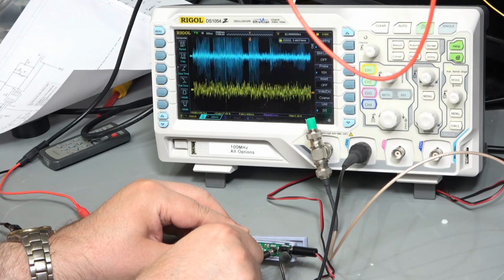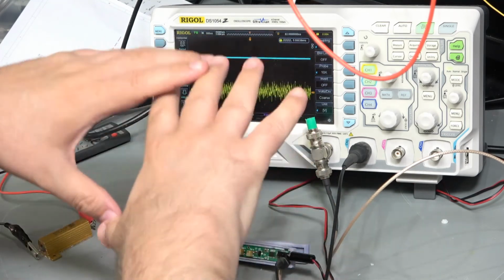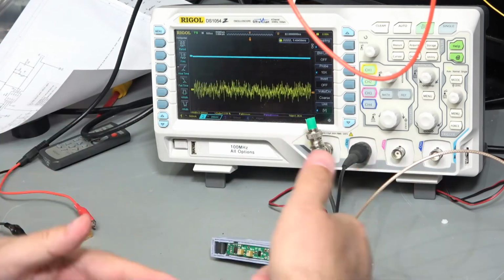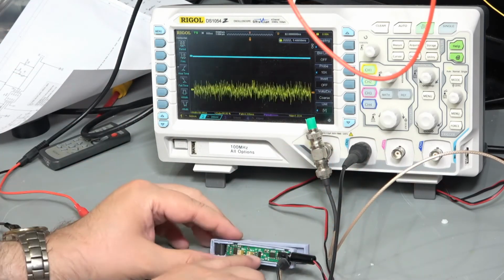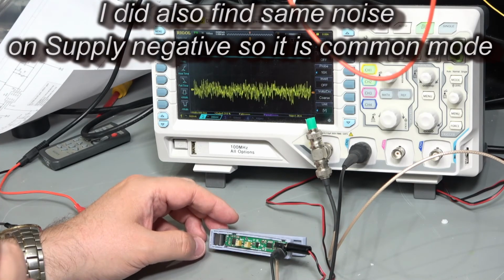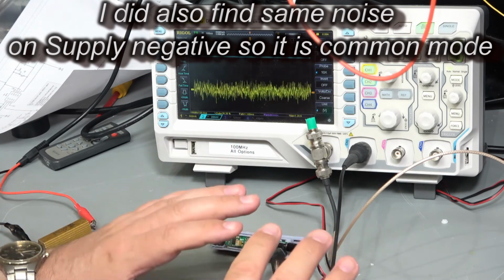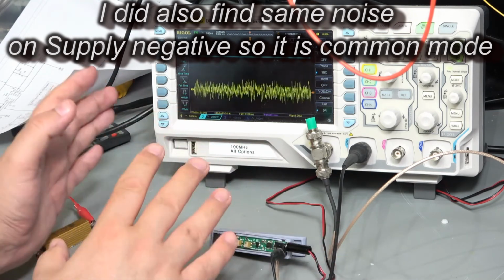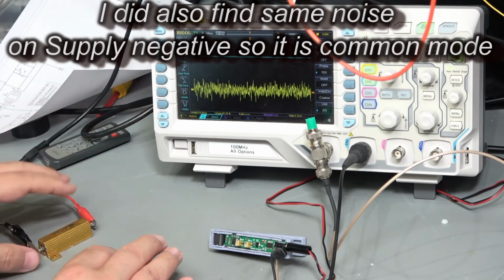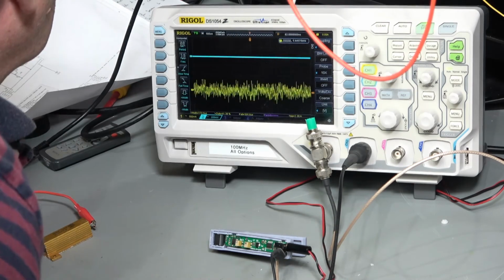So overall, we've got an awful lot of noise going into this circuit, both in terms of electromagnetism around it and the power supply cable coming in and its little internal regulator creating a little bit of high frequency noise as well. So I'm not going to bother to try and make this work with an AC signal on a scope. We are way off where we need to be for that.